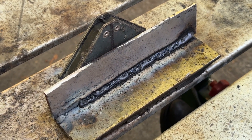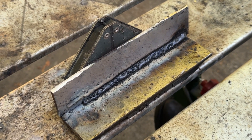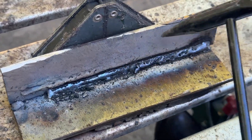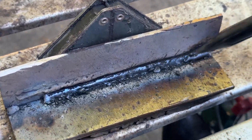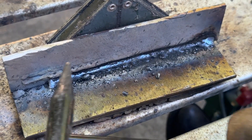I'm actually really happy to report that they worked surprisingly well. Even though I got them at a suspiciously low price and the slag looked pretty strange, they performed nicely. For what they cost, I'd honestly recommend them to beginners or DIYers. These particular ones are 2.5mm electrodes, and after filming I went ahead and ordered some more — about €3 per kilo. They'll last me ages. Good job there, Parkside.